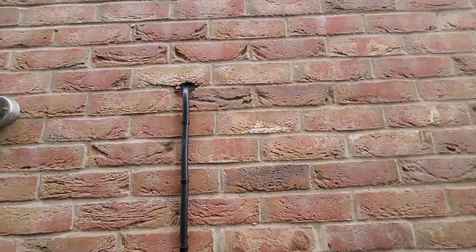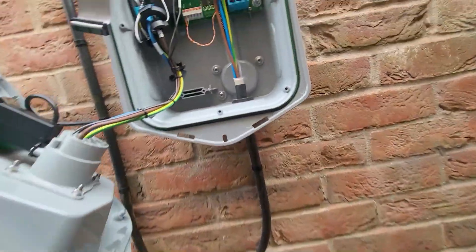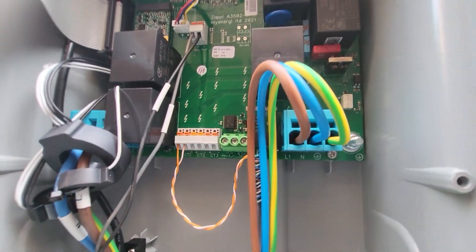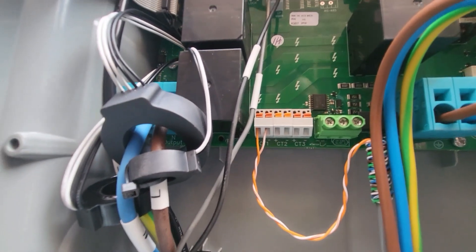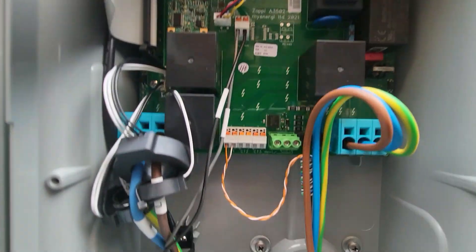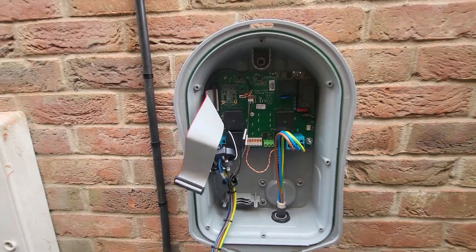You can see we've popped out of the brickwork there - luckily we came out on a join and have been able to seal nice and tightly. We've gone for the Linnean super clips dropping all the way down and then looping into the bottom of the Zappi with a nice gland on there so it's well sealed. You can see these are push-fit terminals - that's a nice way of ensuring your connections are sound and solid and the manufacturer is now taking ownership of that. The same applies for the CTs with little push-fit terminals there. Matthew's gone for his signature move wrapping the spare strands around the ethernet cable that's inside and we've got the ribbon ready to put in.